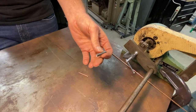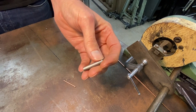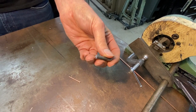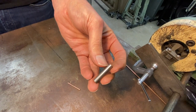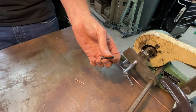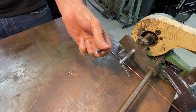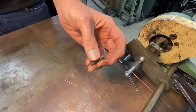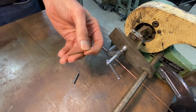This is really a very base first process, first operation machine. Just grab a piece of stock off the rack, cut it a little bit oversized in this, and then machine it afterwards, or bend it, or do whatever you're going to do. It's way faster than cutting on a saw. A horizontal bandsaw would cut the same stock pretty reliably, or you could use a jeweler saw or something like that for the small ones, or a cutoff wheel.